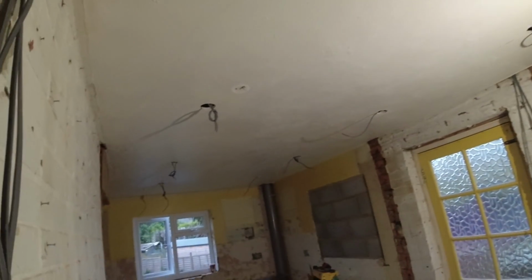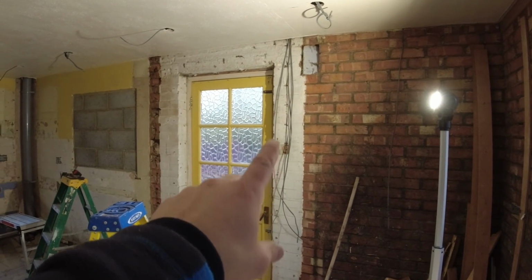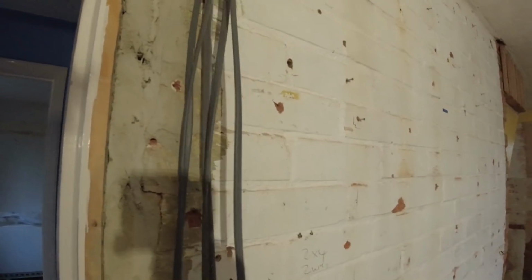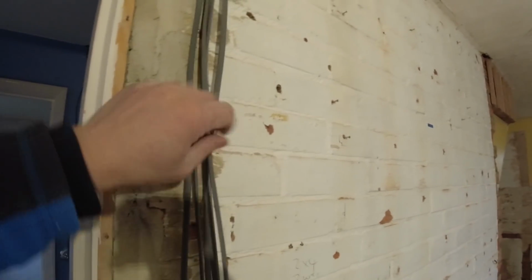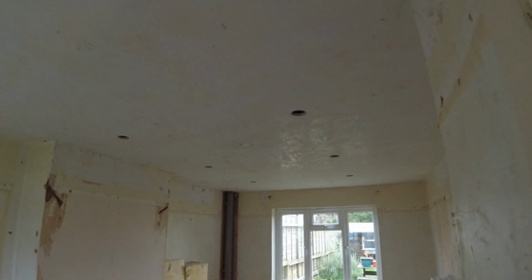Look, we've already wired the downstairs lighting, 2-way to the back door. That's going to be outside lighting feed. This is the kitchen switch wires, and it's just poking me a feed down. That's a switch feed. That'll be a feed on for the hallway light here. And then the feed will drop to here. We'll probably wire these ones tonight as well, quickly.